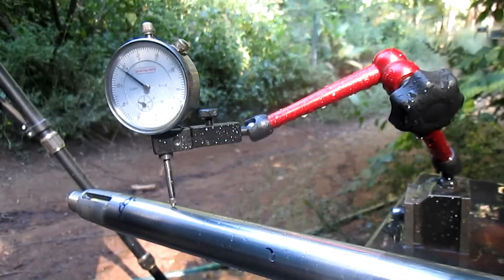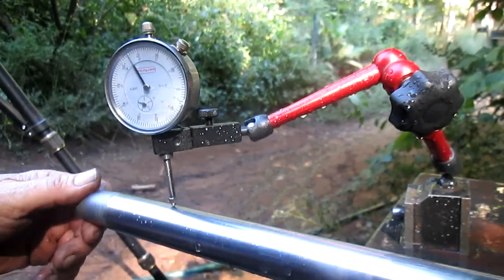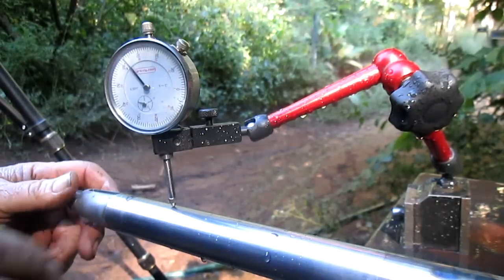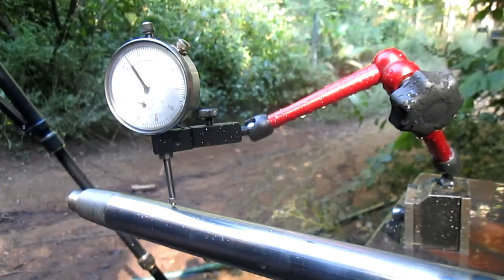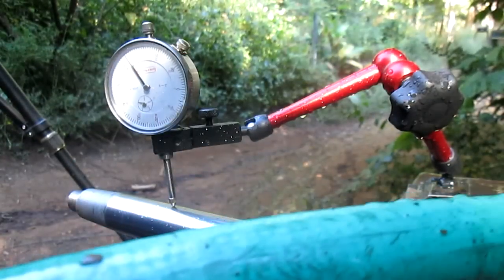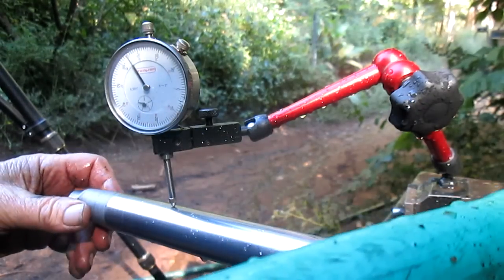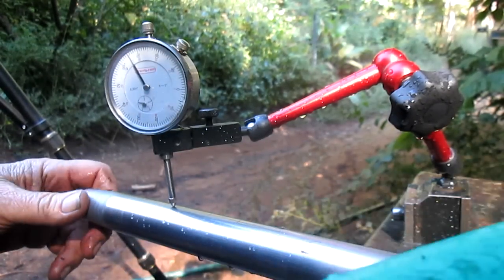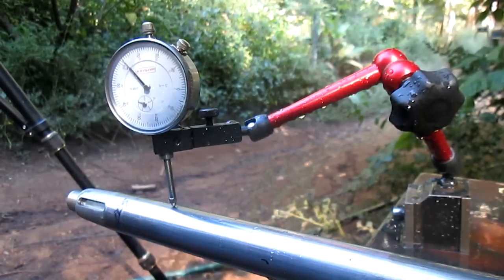All right, this is fighting me a little bit. I gotta find a place to sit down. All right, that's better. Okay, we're still down to 5 thousandths. Our shaft is a little bit warm, so let's go ahead and cool the shaft off a bit. Great, we got everything wet. Now nothing will work, or the striker won't strike. We'll be back.